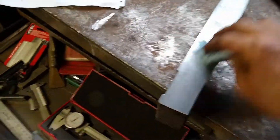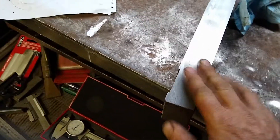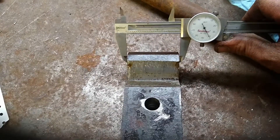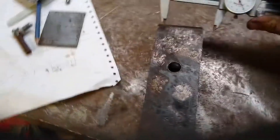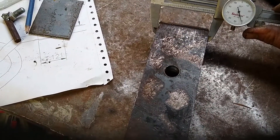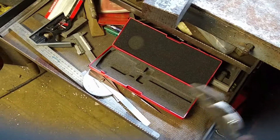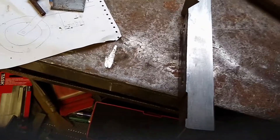So this is the second one I did. I'm quite happy with how that turned out. It's pretty smooth — a little bit of sandpaper — and I would describe that as a relatively smooth surface. The big question here is, do things end up square? It's around 40 all the way around. So it's flat. I've made a piece of metal that is flat and parallel on two sides, which I've never done in my shop before. And it's all thanks to the English-made tooling.